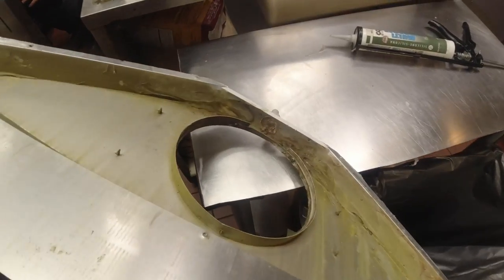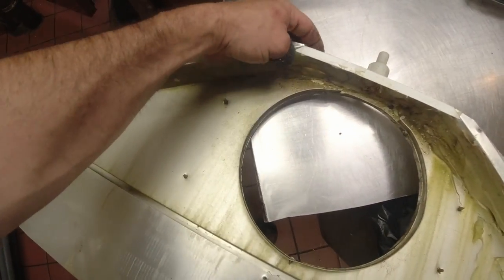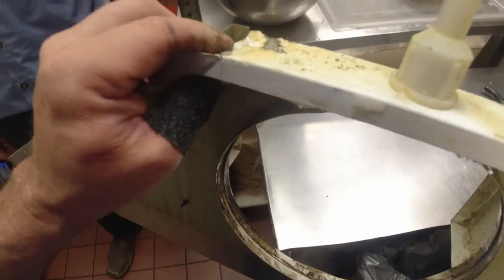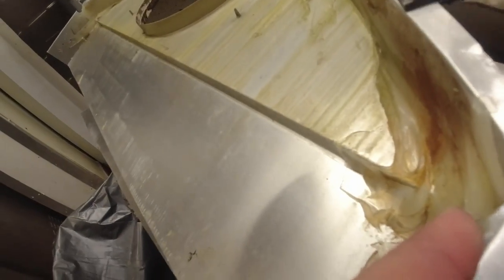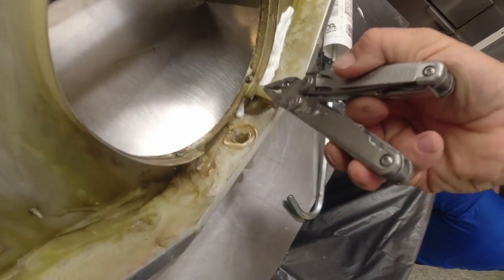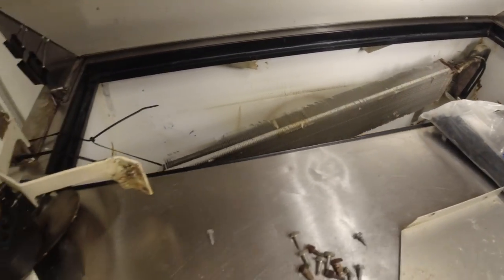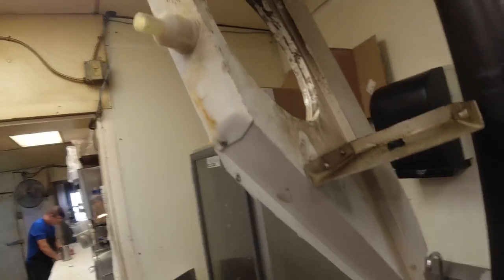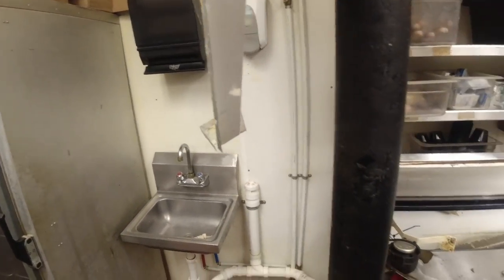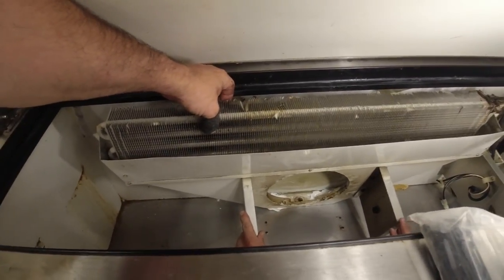Silicone does not hold up against underwater very long - that's why you never use it on penetrations on your roofs. It will leak. I've had several calls because of it - that's why you've got to use the right caulk for the job. We're going to try to silicone it up but also check to see if we can get a new piece. Look what we found - that is loose as a goose. Let's see if we can get that new piece. The coil looks like crap but this is kind of generic.